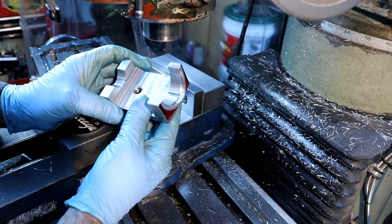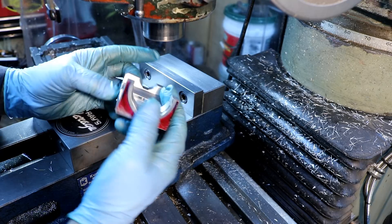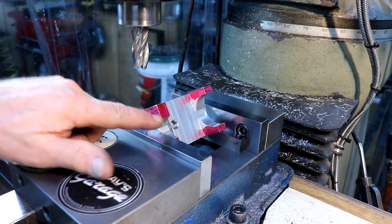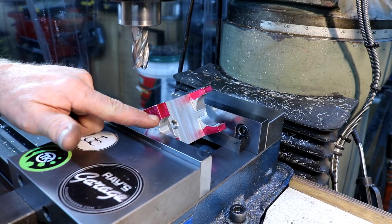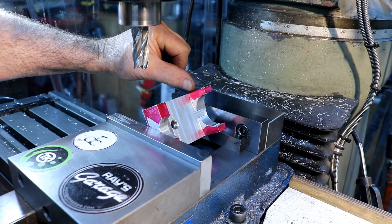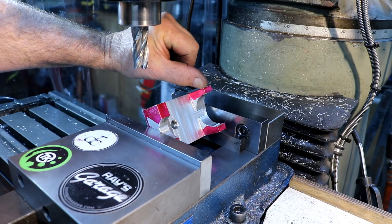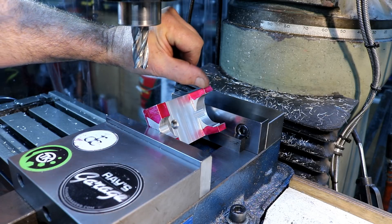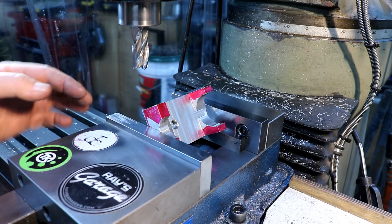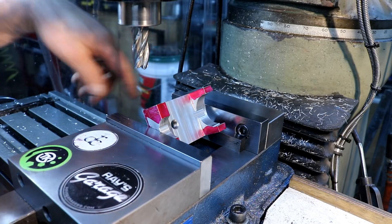It's got a little deburr. Those came out really nice. We are almost done. Time for the angles for the straps — we'll do both sides. This end here will be 30 degrees, both sides. And this is a very slight angle — I don't even know what the angle is, I just kind of drew a line. It's very slight, maybe 10 degrees roughly, that we'll do over here. And then we're going to put slots in those sides also. I'm going to cut the angle and then slot it all the way through.